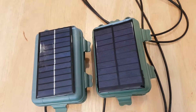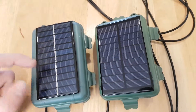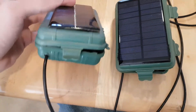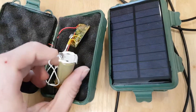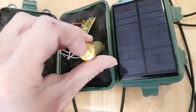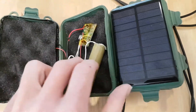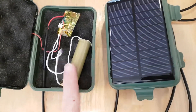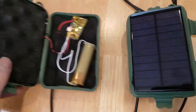Good morning everyone. This is my original trail camera battery box. It's a 6 volt, 1 watt solar panel. I used a soldering iron to melt a little hole and I used this little circuit board. My batteries were recycled, so I already had a little metal plate to solder onto. Normally you don't want to solder directly onto these batteries — you don't want to apply too much heat for too long, you can damage the battery. But that's what I was doing. The setup works real well, however I have an improvement.